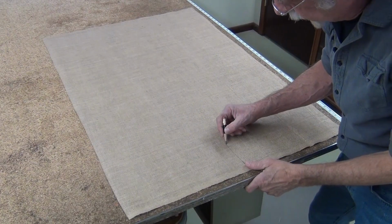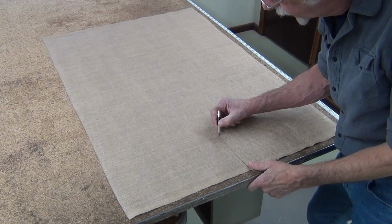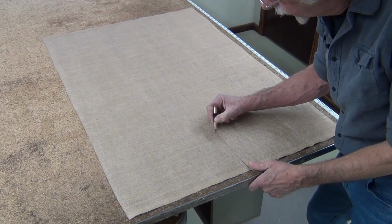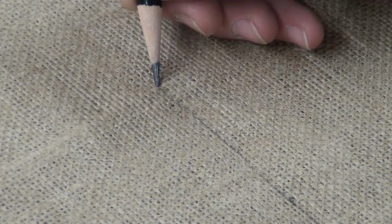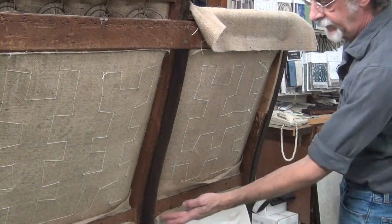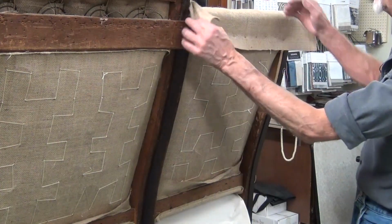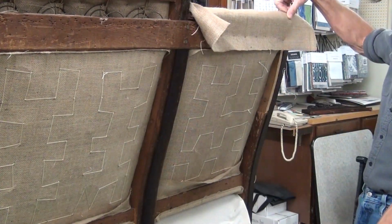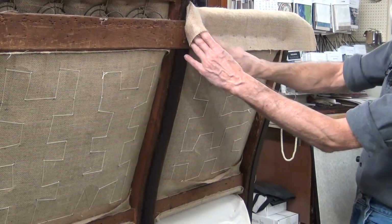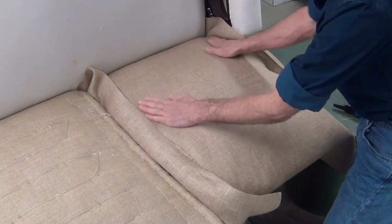With the wood wool in place, I'll mark center on a panel of burlap, strictly following the yarns. I've stapled the burlap evenly across the bottom rail, pulled it tightly over the top, keeping the weave even across the rail. Use temporary staples because I'll need to adjust this.